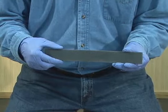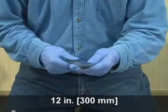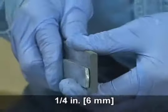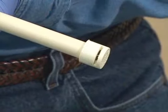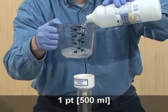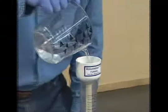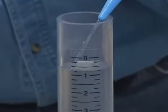The strike-off bar shall be a flat, straight bar at least 3 quarters of an inch wide and 12 inches long. Steel bars shall be at least 1 eighth inch thick, while high-density polyethylene or other abrasion-resistant plastic bars shall be at least 1 quarter inch thick. The funnel minimizes any disturbance to the top surface of the concrete as water and alcohol are added to the meter. 70% isopropyl alcohol is added to the meter using a measure with a capacity of at least 1 pint and graduations no larger than 4 ounces. A container of approximately 1 quart capacity and a syringe are used to add water to the zero mark on the meter.